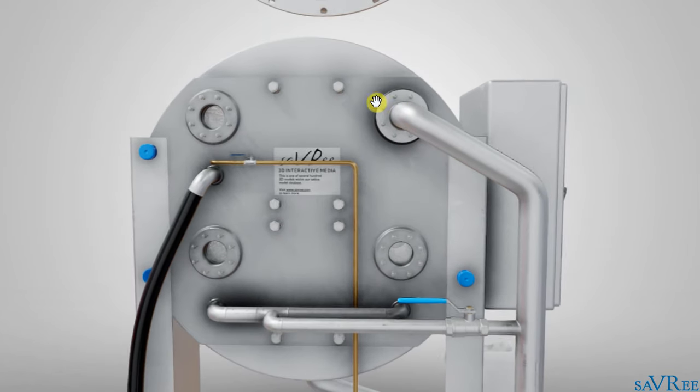Notice also that we're passing the seawater through the condenser first, and then feeding it to the evaporator. We do this because the seawater picks up a little bit of heat as it passes through the condenser. By passing this pre-heated water to the evaporator, we save some energy and make the plant more efficient — we don't need to take as much thermal energy from the jacket water system because we've already pre-heated the seawater. It's a very simple and effective means of increasing the efficiency of the plant.